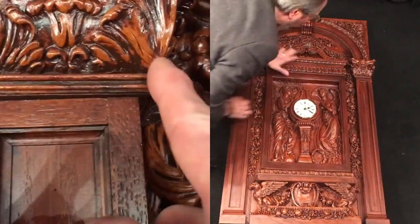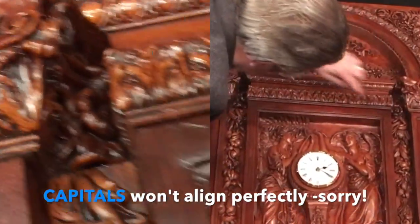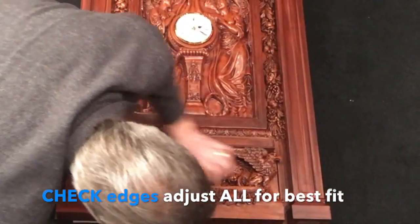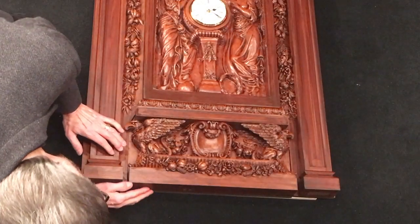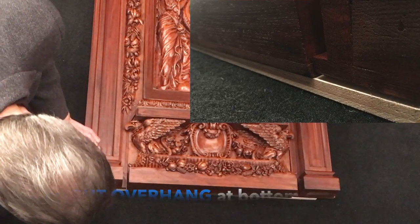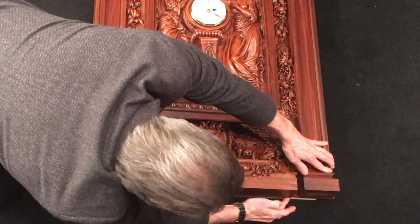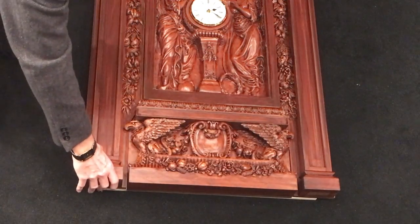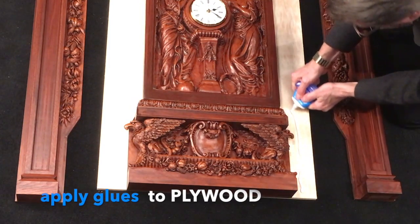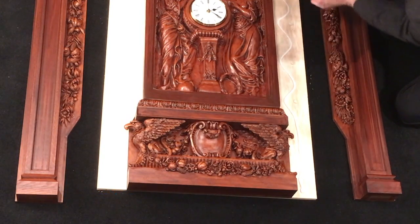It's not a perfect fit. Look at the capitals — there's an overhang on the inside. When I sculpted all of this I tried to get everything perfect, but the problem is resin shrinks. Here's that overhang — it's just maybe an eighth of an inch. I was going to say that resin shrinks and we have a lot of different thicknesses here. Some pieces are very deeply cut and very thick, so there are variances with the curing. It's just not a perfect science.